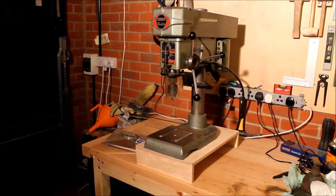As you can see, the drill does fit onto the wooden base, but with all that weight on there it's going to need some reinforcing. I'm going to put a spine up the middle to support it along the length of the wooden base, and then almost like a set of ribs come across it. I'm also going to modify it further — I'm going to cut a hole in the middle underneath the fixing so that I can change the drill platform for different jigs and templates depending on what I need in the future.